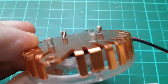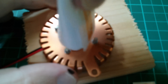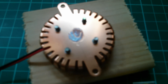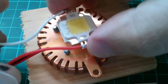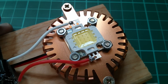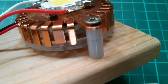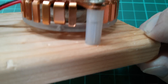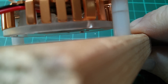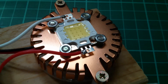Now let's mount the LED onto this top flat surface. A tiny bit of heat sink compound — just to fill the gaps between the LED and the heat sink, so that's probably enough. The LED is bolted to the heat sink with four nuts and bolts, and I've also mounted the whole assembly on a small piece of wood with pillars, leaving plenty of clearance underneath for air to flow up through the fan and out through the vents to keep the heat sink cool.